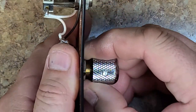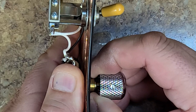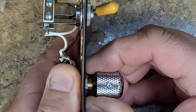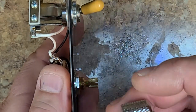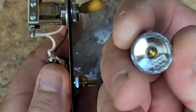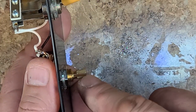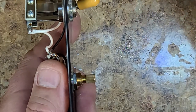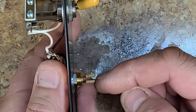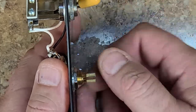Another thing, when I put these on, and I don't think the last person did it either, so I'm going to slide this out very slowly so I don't change the angle of the post when it comes out. Oh, they did. Nice job there. What I'm talking about here is, you see that set screw right there? When you tighten up that set screw, you want it to tighten between the shaft over here, where it's split, because if you do it on the side over here, all you're doing is bending that in, and the knob will come off. Or what I've done before is put a sliver of wood inside there. That way, it doesn't matter which way you put the knob on. Either way, it's not going to slide off. It'll be nice and tight.